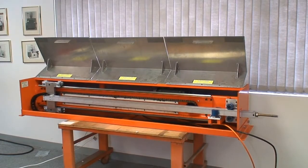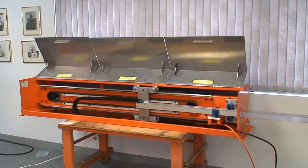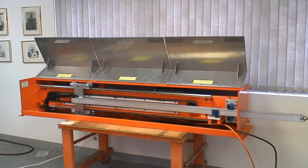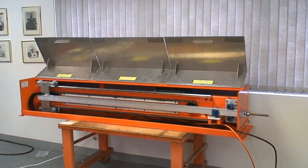One of the interesting features of this new series of reciprocators is that the motor can electrically reverse. I've changed the program parameters so that the length of the spray stroke is 40 inches. Goes out at high speed, but then the traverse reverses for the actual painting stroke. By reversing, the control has decided that this is the shortest way to make this painting stroke. Had the chain continued going forward, it would have taken more time to go down and around the end sprocket.